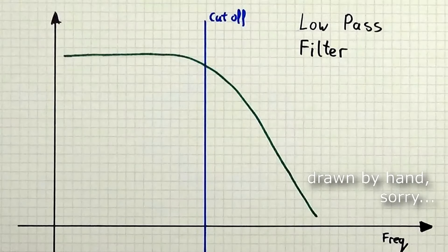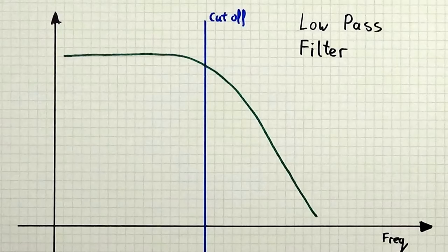Before we proceed further, let's do a digital filter 101. What's the difference between a low pass filter and a notch filter, and why are we using notch filters to filter the gyroscope? A low pass filter is designed to attenuate frequencies above the cutoff frequency. In filter theory, the cutoff frequency is defined as the frequency attenuated by the filter by half. Simply put, everything below the cutoff frequency should be left unattenuated; everything above should be attenuated — the higher the frequency, the greater the attenuation, though this is not a linear dependency.